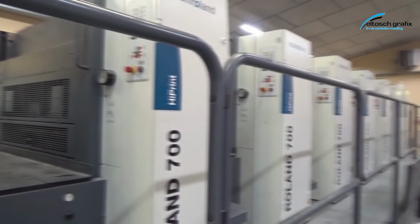When we installed the press in Söderköping some weeks ago, we placed LED UV ink at their production site, and nothing regarding curing happened during these weeks when the ink was all in traditional production light. So to have the ink cure, it needs to face this LED UV in a special spectra, and when the light hits the ink in this spectra, the ink is curing.